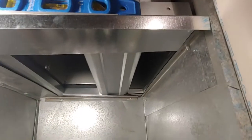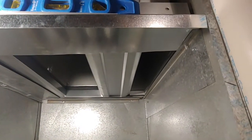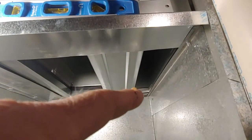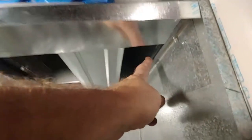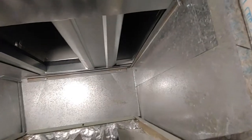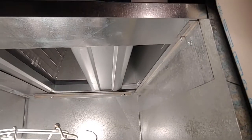As you can see, our end coil has that little airflow opening on that side. You've got to make sure your rails are certainly not sticking out any further than the opening in that end coil. Or you're going to have a freeze-up situation for sure.